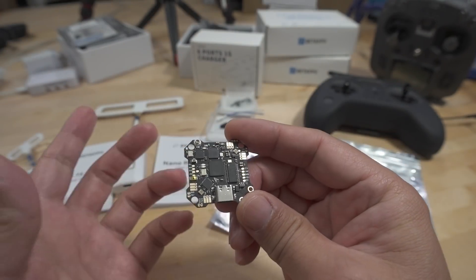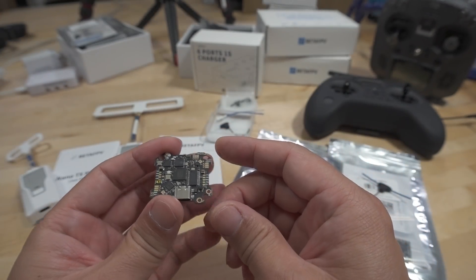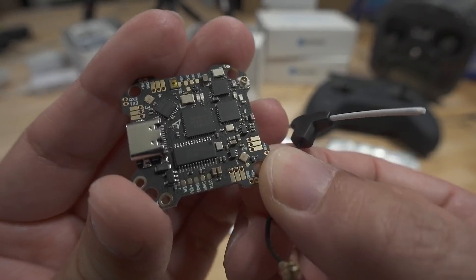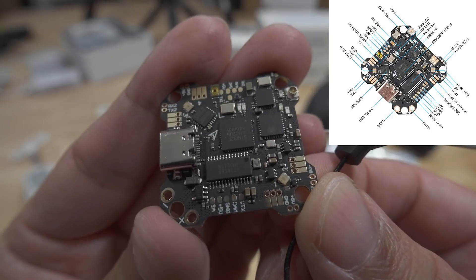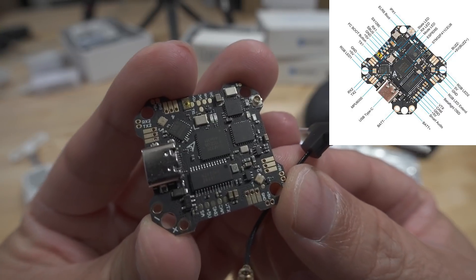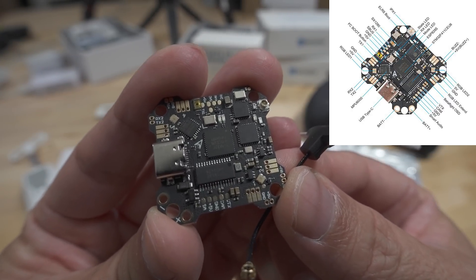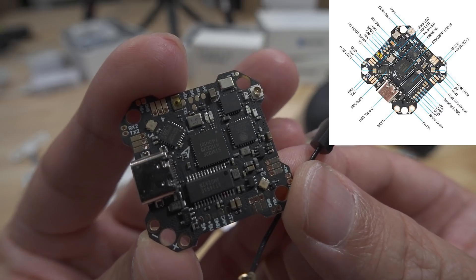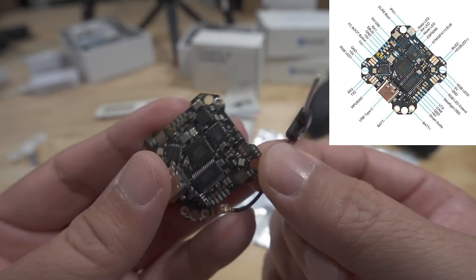I have put this in here and it works — I've bound it to the all-in-one flight controller board and I can see how it's working. So, this is the all-in-one flight controller board. It has USB-C, it's 1 to 2S, up to 12 amps continuous and bursts to 25 — pretty huge in terms of power capabilities.